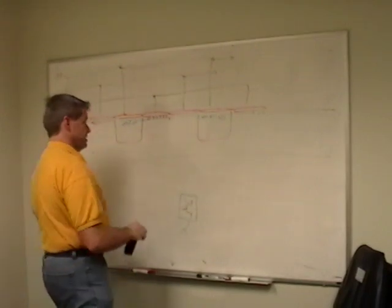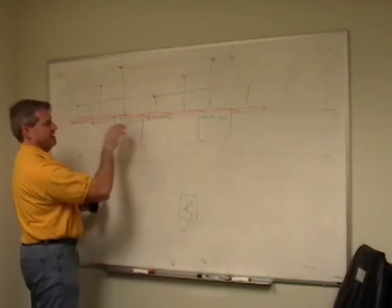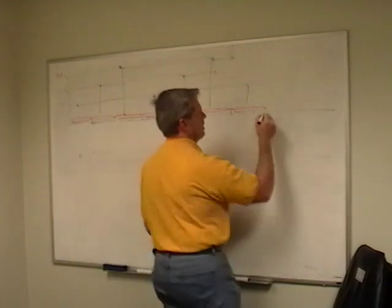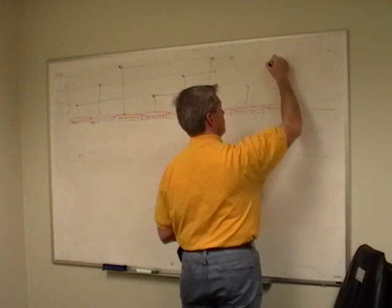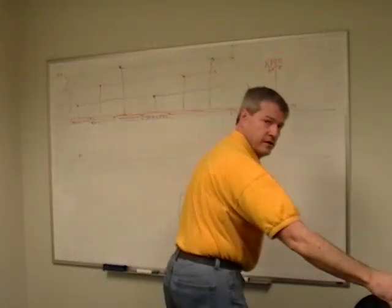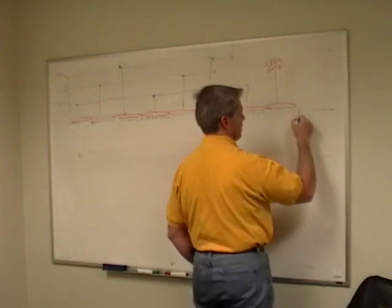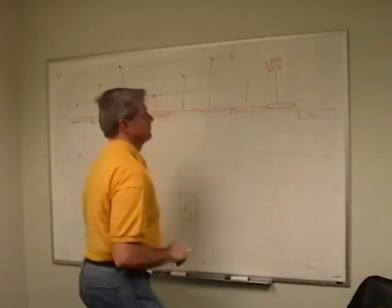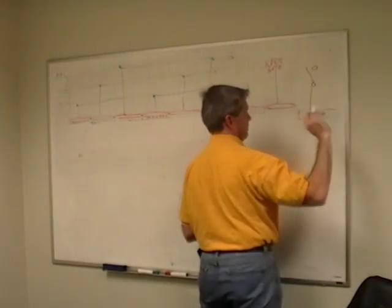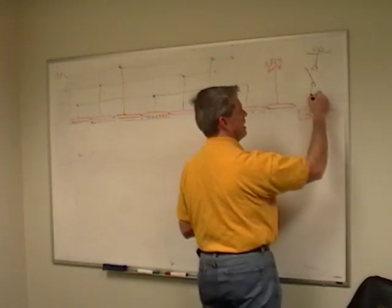We talk about charge transfer efficiency, CTE, not to be confused with the coefficient of thermal expansion. And that has to do with how many electrons get left behind when you move them along. So eventually, you get down here to the end. And we have our transfer gate, and we have an N plus. And he is tied up through a switch somewhere else on the thing to some gate potential. And we take an output here.